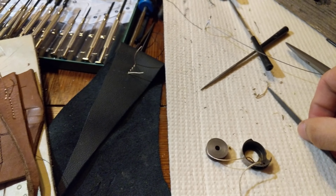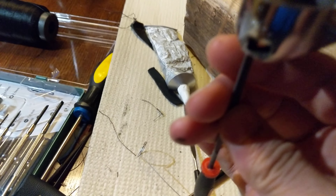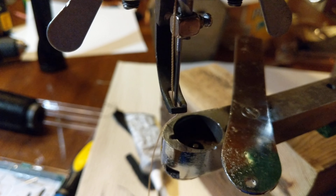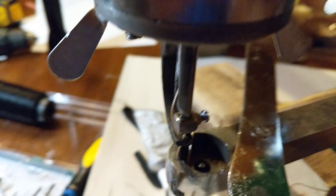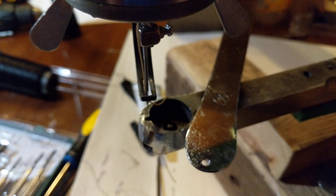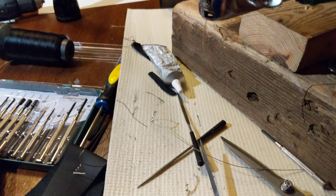What I did was take one of these little flat files. There's a hole right here in the bottom — stick it up through here and file that spot until the needle was able to fit down through it without being impeded by the wall right there. Before the modification, it would push the wall and bend forward, which wasn't working.